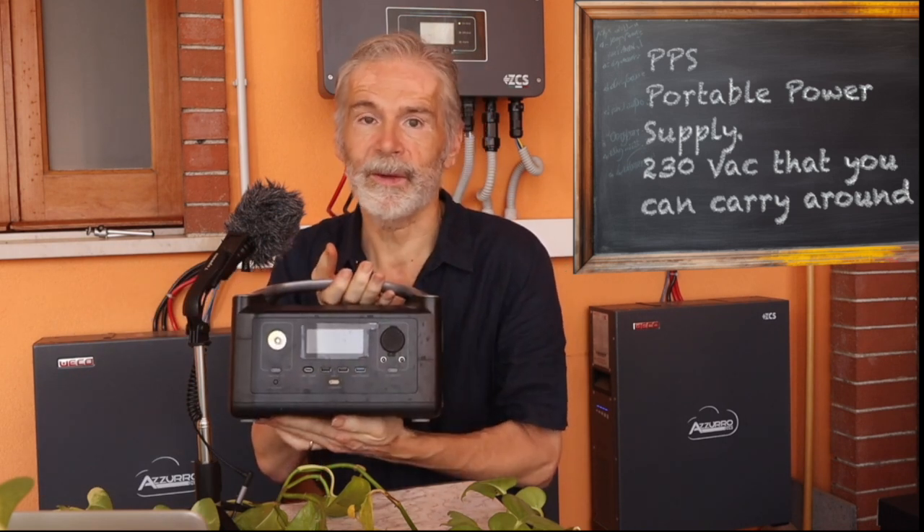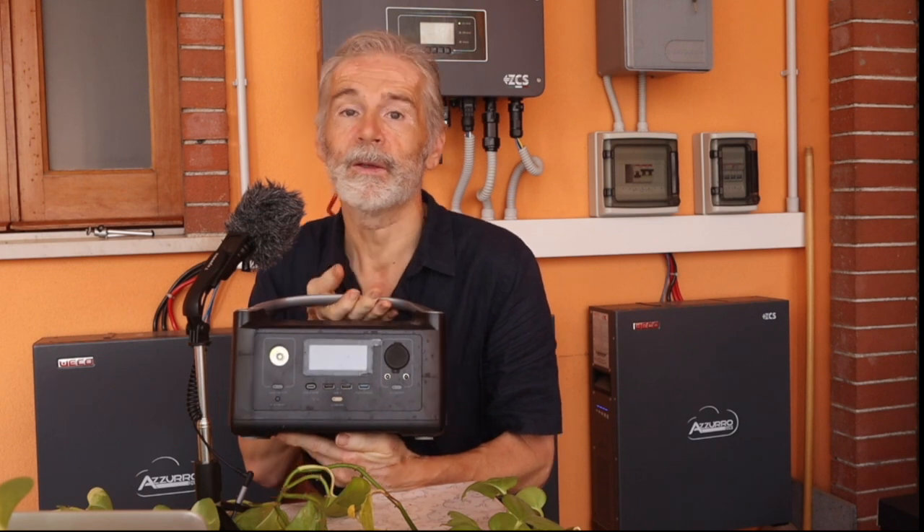Here's a personal insight. I was planning to use grid-tied solar panels with a small portable power supply to provide a 50 Hz reference frequency and a 230 volt reference voltage that these inverters need. I could use this portable power supply and combine it with a few solar panels — much bigger in power than the EcoFlow — with the panels feeding the AC side at a much higher power. However, after some research I found that this configuration would actually damage both the portable power supply and the grid-tied inverter. I can feed PV power only at the input of the portable power supply, so the disadvantage is the limited power at both the input and output. But the advantage is that the energy is stored — I can put away a few of the sweeter apples.